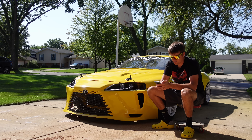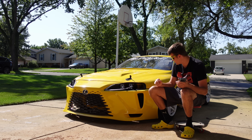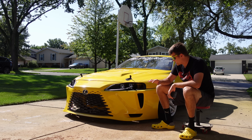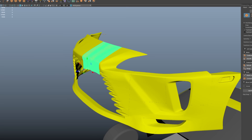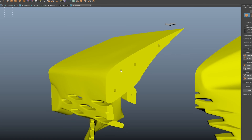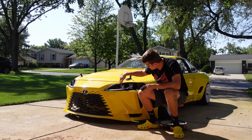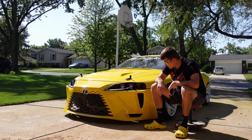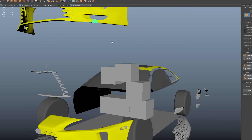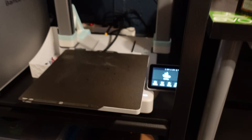Next question: how do I split up the model to be printed in pieces? I don't have an eight-foot printer, so I use my Bambu Lab printers. The way I split it up is I create boxes that are the size of the print area for my printer, then lay them over the model in the best printable way possible — avoiding giant overhangs. Then I add all the little alignment pegs. It's a lot of work and there are probably easier ways, but that's how I do it and it works for me.